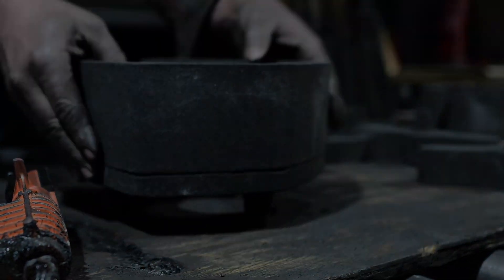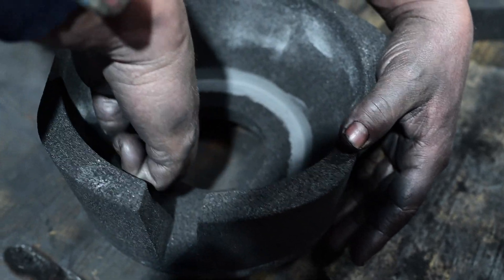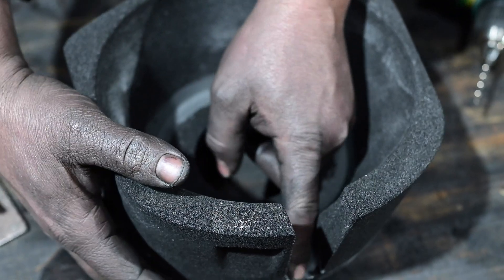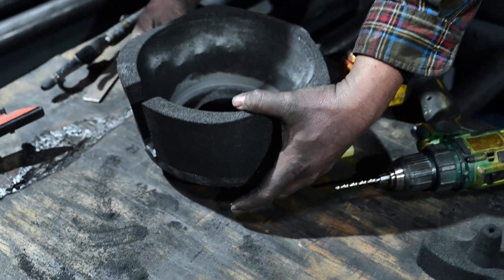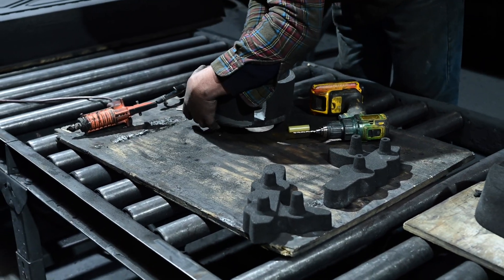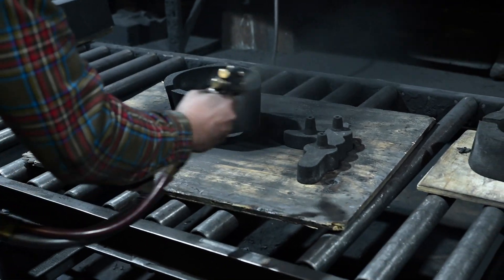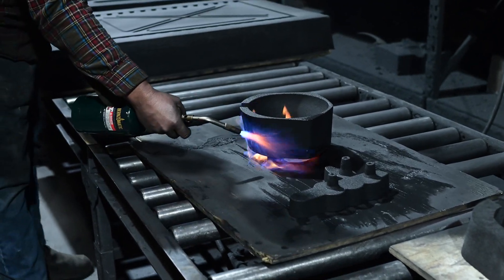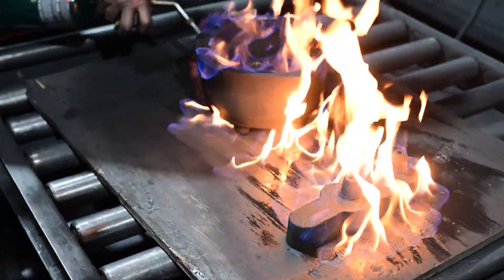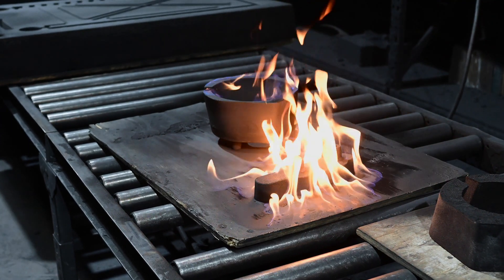What you're seeing are these parts, which are very carefully assembled — they will go inside the mold to produce the empty spaces. You can see all the intricate handwork. This is done by Jesse, the sculptor-in-residence of the foundry. The care placed into this work has a direct result on the finished product, because any imperfections or voids are going to show up in the casting. This is inside the K3 casting, but on the outside, we wanted to get as perfect a casting as possible while still allowing the process — sand casting — to be readily apparent.